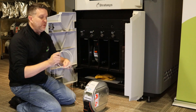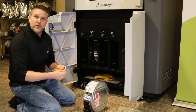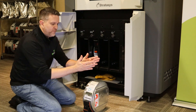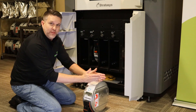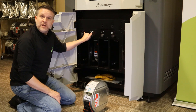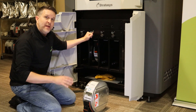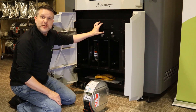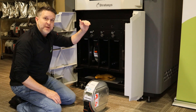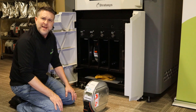As an important note, you did not waste this material — you're not spending money on something you're throwing away. This is all accounted for by Stratasys; it's extra wound material on your canister. The money you paid for the 92.3 cubic inches on this spool are on there for you to use and do not account for about eight or nine loads or unloads of material. As a review: clear or solid red means the canister is empty. A slow flashing green indicates it's loaded right here to the drive block. Fast flashing green means it's doing something — leave it alone. A solid green indicates it's loaded all the way to the head. Those are your lights — hopefully a good review of the drive blocks.